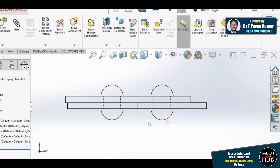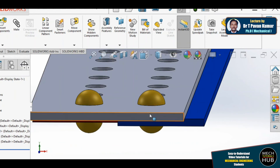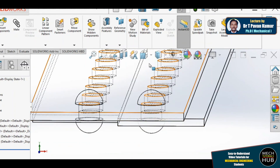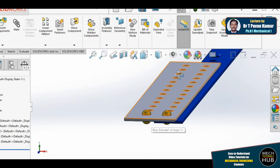Viewing from the front, this is what you do for a butt joint. I joined the two sheets with the help of a strap maintaining a thickness of 1.125t = 4.5 mm. The two sheets have a thickness of t = 4 mm. The rivets appear as hidden lines because they are placed away from the front edge — between the observer and the rivet there is material, so the shaft is not visible.